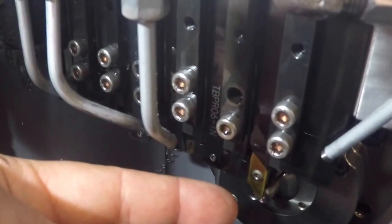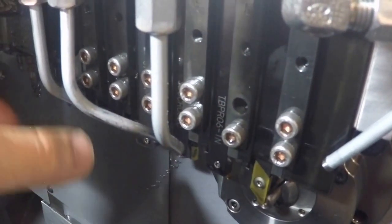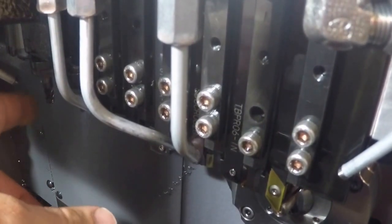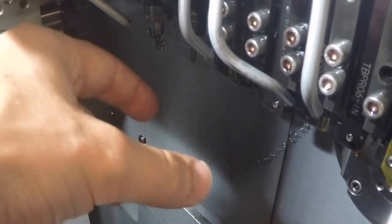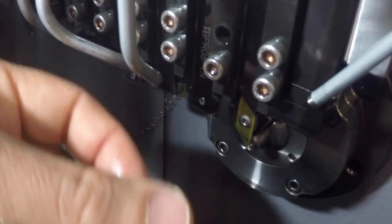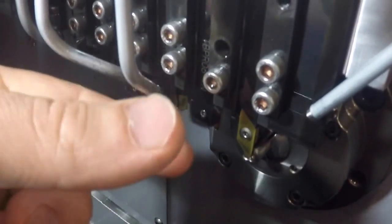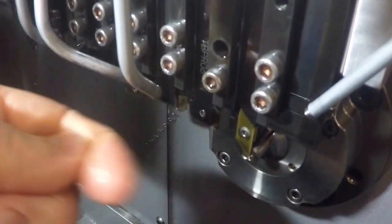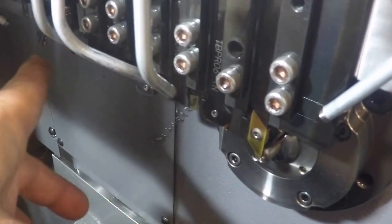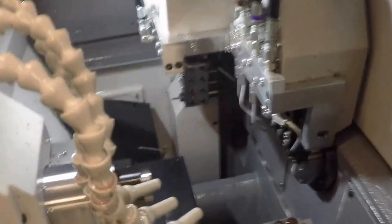And then you would program, if you want a flat that's 250 across, you'd do 250 for the width of the part plus 250 for the width of the tool, and that would give you a half inch, and that's actually what you would program, a half inch to mill a quarter inch flat across a part. And then you'd rotate it 180 degrees and run that tool path again, and that would give you a flat width of 250. So that's the only kind of confusing thing.